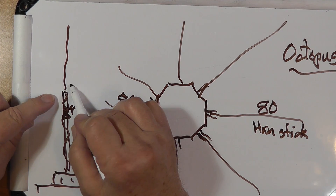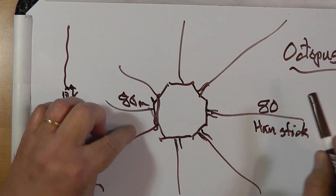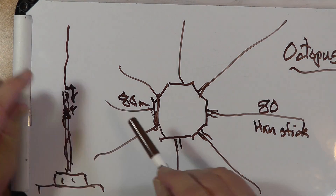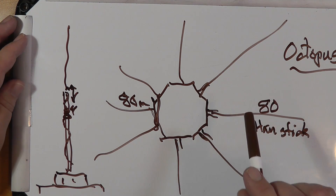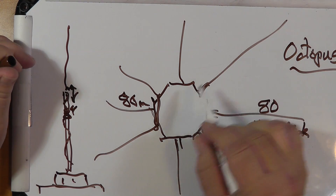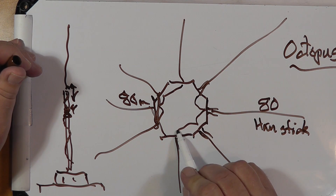You tune these things by pushing the stinger in and out, and there's a little screw lock on it to keep it in place. You have to tune each of them. The idea is if you take these and put them opposite each other, you get a dipole — a loaded dipole. You have to tune both sides to the same frequency so that the stinger length matches. These are all connected in parallel: one side — positions one, two, three, four — connected together as the hot side, and the others connected to the ground side of the coax.